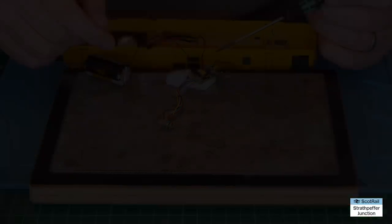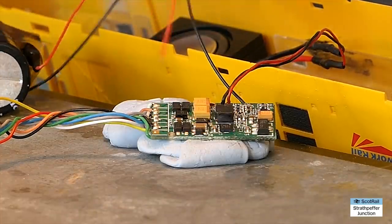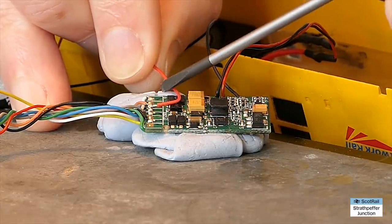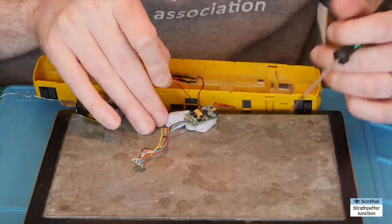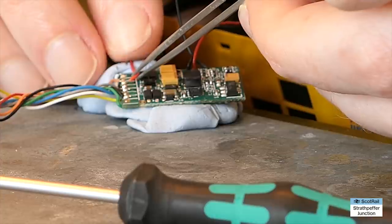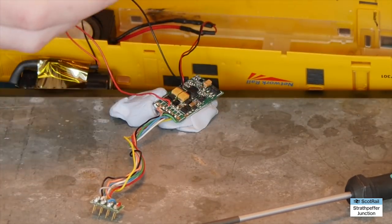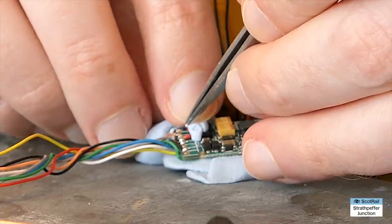I've flowed a small blob of solder onto the top of the pad. I'm going to bend this wire very slightly and bring it in so all the wires come out in the same direction and can be wrapped up together. I'll secure this into place again with some blu-tack — just in there — and get it soldered onto that tab. I'll just use these little tweezers to get everything lined up exactly where I want it. I'll take a little bit of blu-tack and stick it behind this wire here just to make sure everything is in exactly the right position.